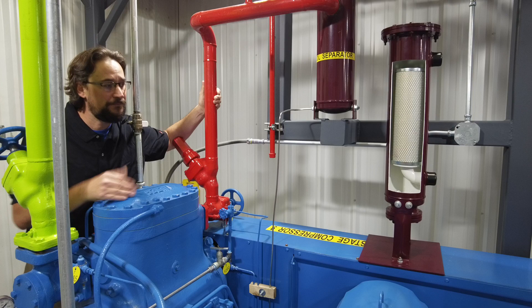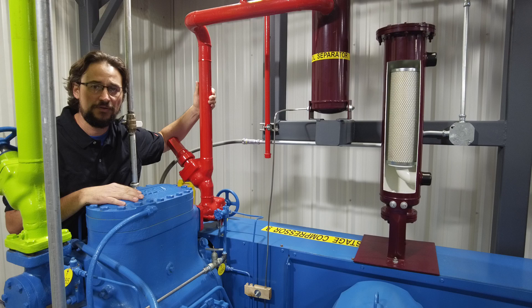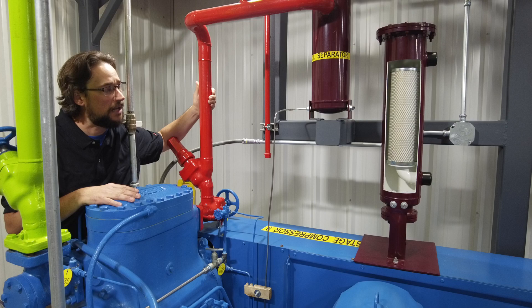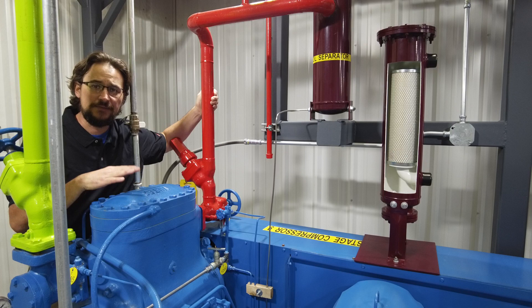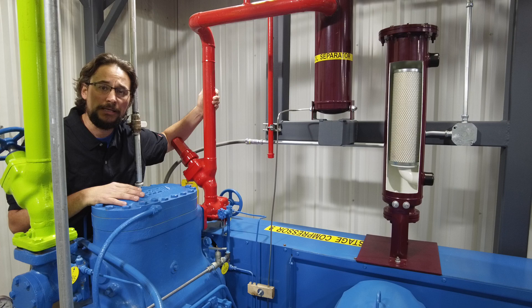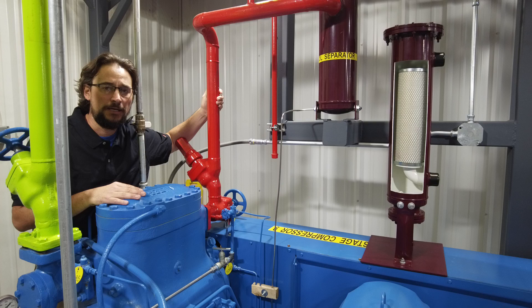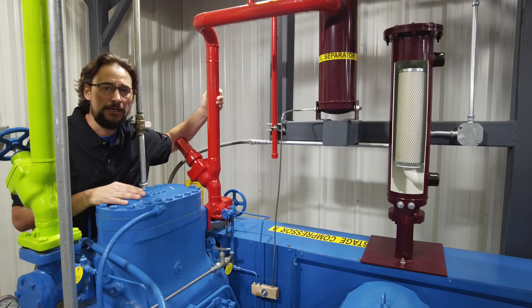Let's give a shout-out to Temprite — number one for allowing us to use their cutaway here, and number two it's an awesome product. You can see we've got them installed. The website is Temprite.com. They build oil separators, accumulators, receivers for ammonia, CO2, and halocarbons. A little bit of oil separation safety for those taking our Operator 1 or online Ammonia 1 course: we've seen a head ripped off a compressor because of an improper startup — the tank filled up with liquid ammonia, they tried turning it on, and it filled the entire crankcase and cylinder walls. Pre-inspections before firing up are essential. My name is Jeremy Williams representing Garden City Ammonia Program, gcapcoolcast.com. Thank you to Temprite for the cutaway and sponsorship. Till we see you all again, let's keep it in the pipes.